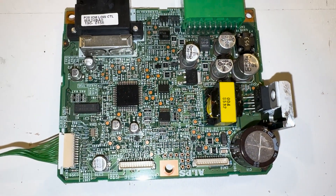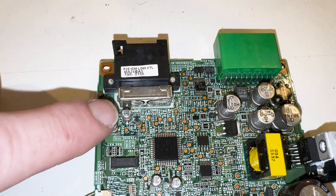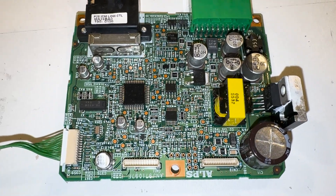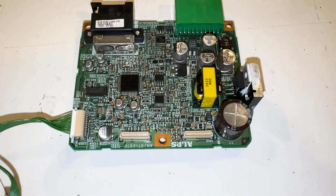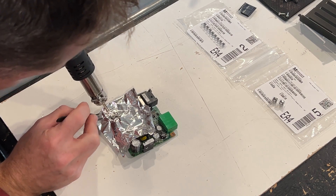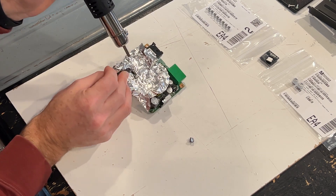What I'm going to replace is right here — these should be the 100-microfarad capacitors, and this should be the 10-microfarad one. One, two, three, four, and then this single one. None of them look bad; I don't see any leaking or anything. I don't have a tester so I'm going off somebody else's guide. A lot of times you can send these out and a company will redo this for you, but it's like $350, so I definitely want to try to do it myself. No need to send comments on how bad my soldering technique is — this was my first time learning about surface-mount solder.